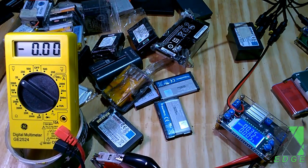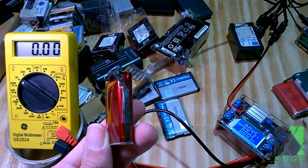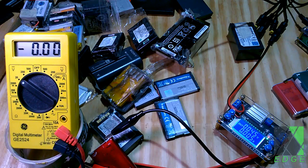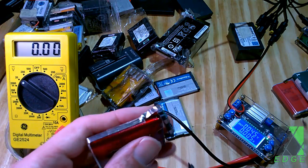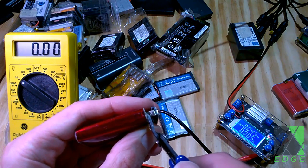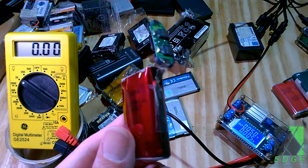After a couple of minutes this battery has come up to about a third of a volt, which is not very good — it's certainly not proof the battery is going to be all right. I'm going to charge this battery to a reasonable voltage, about 4 to 4.1 volts, and then let it sit. If it holds the charge it's good; if not, I'm not going to use it. I'm very unlikely to use a bulging battery — I could use it for a solar light as long as it's not anywhere it could be a risk. At the very least, this bulging battery helped me identify the polarity of this model.